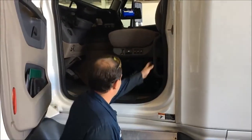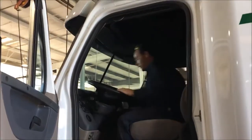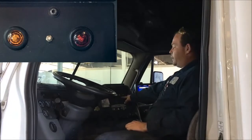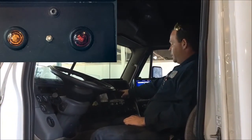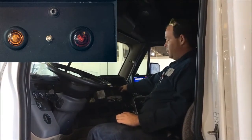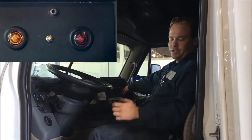Now if you get back up in the cab, you've got these two LED lights. This is an older version of the ECAS suspension system. The amber light is basically an indicator letting you know the tractor is not at the proper ride height. The red light is a malfunction indicator light that will let you know that the truck needs to get to the shop.